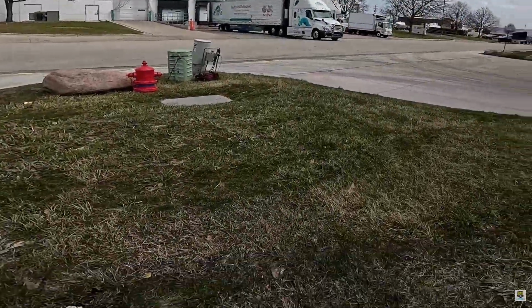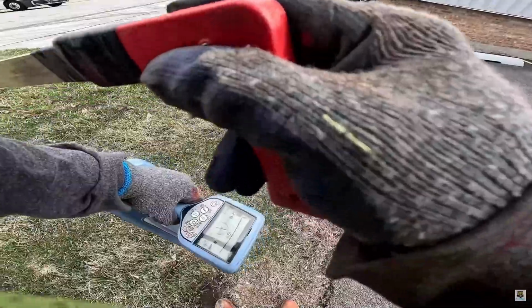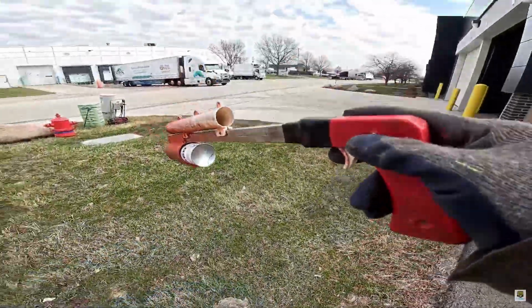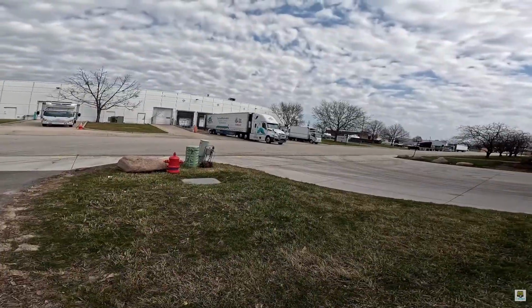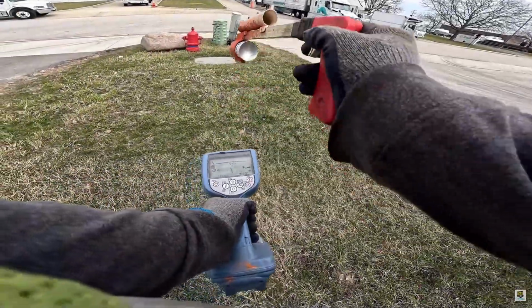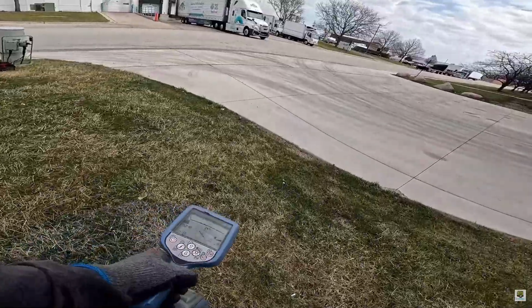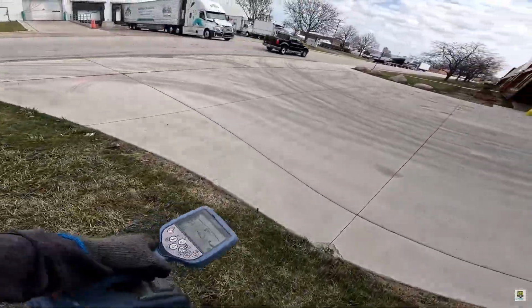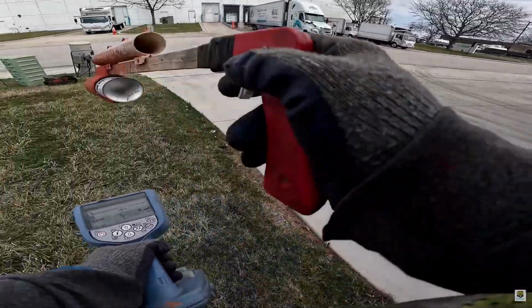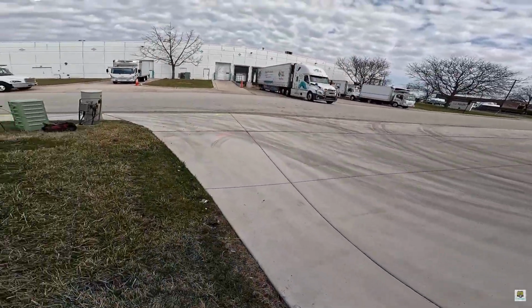And I completed my 360. And you can see my machine was always pointing that way around that equipment that I'm hooked onto. You want to make sure when you're locating, your receiver is aligned with that all the time. You don't want to be cockeyed going like this or like this. You want to be parallel with that all the way around, like going around the moon.